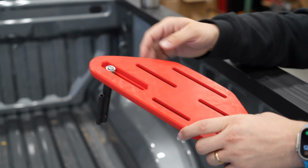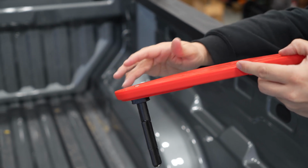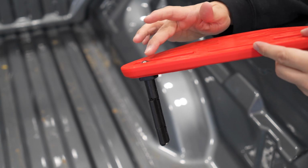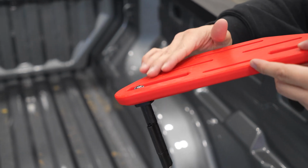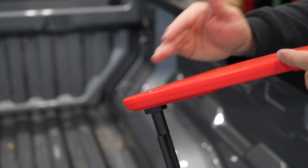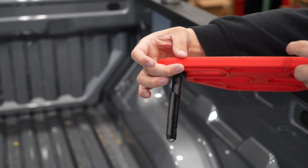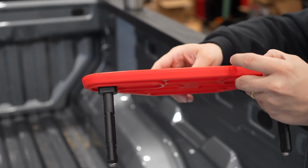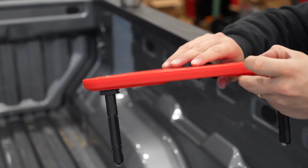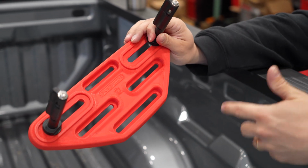The other thing, regarding this slot, is that if you look at a glancing angle, the end of that pin is just a little bit proud of this surface. So if we were to mount something like this on something flat, like a MOLLE panel, the end of that pin may do some damage to whatever we're mounting. So all I did there was thicken up the entire piece by a little under 1/8 of an inch, give it some more meat. And I'm reprinting. Other than that, though, I'm generally very happy with the aesthetic of it, the function of it.